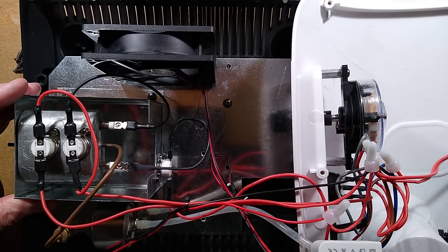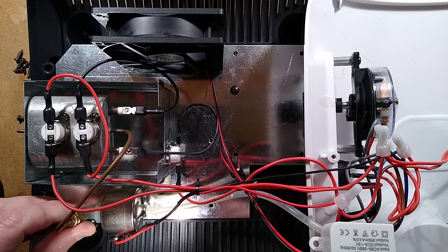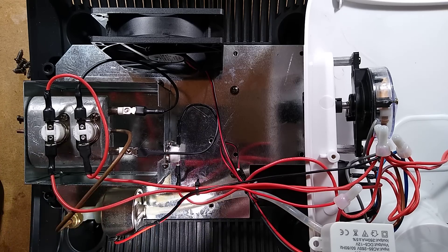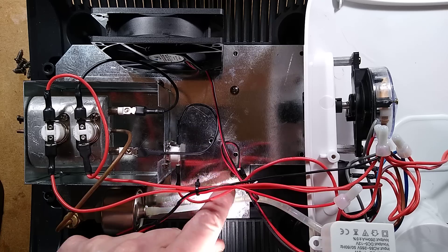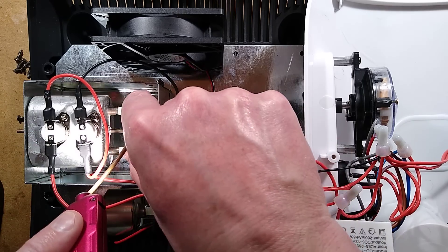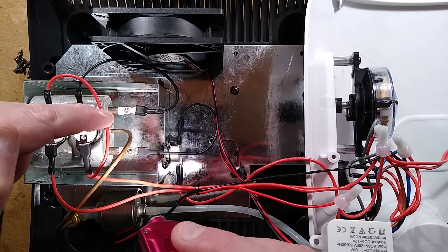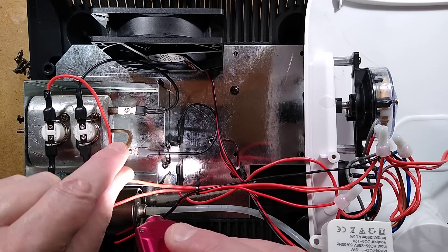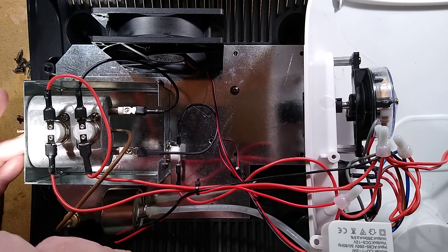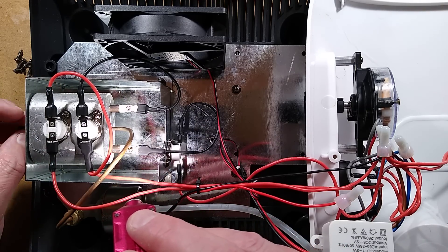Moving down to the most interesting bit: we have the pump. This is a standard solenoid pump used in smoke machines — they could have used a peristaltic pump, but this is a cheap mass-produced component. This is a company that manufactures disco lights and they've just adapted their business to fogging. It takes liquid in along a silicon hose and pumps it through a copper pipe into a block. The block has a fairly high-power 900-watt heater in it, and the heating element is surprisingly short for 900 watts, but it will be a U-shape inside the aluminium block, with the copper pipe wrapped around it in a spiral. As liquid is pushed in it gets superheated, turned into vapour, and blows out the end.